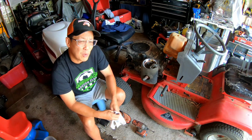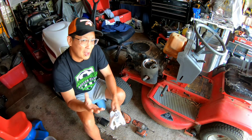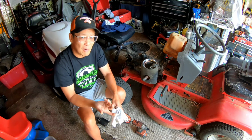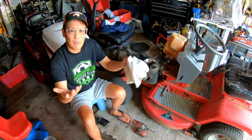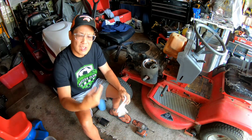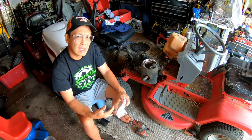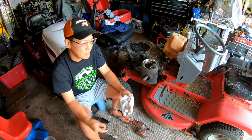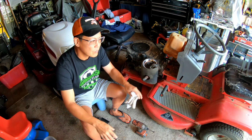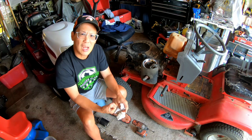I think the transmission is frozen because it's a 5-speed. I've never had it so that it doesn't roll. It could have been the brake caliper, but as you recall, when I jacked it up in my van, it's not frozen up because, you know, when it's off the ground, it's not posi traction, right? So you rotate one side of the wheel backwards, the other one goes forwards, and vice versa. If the brakes were holding it, it wouldn't be able to spin at all. You know what I mean? But then again, once both wheels are on the ground, the gears would have to move along with it, so it might be just jammed, you know?